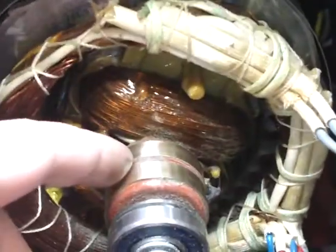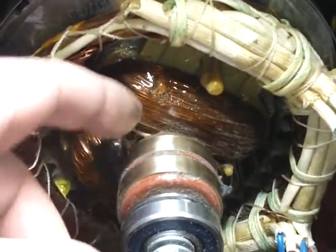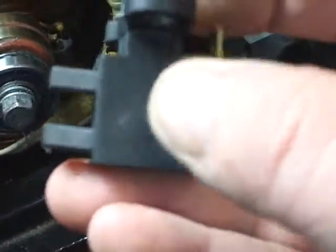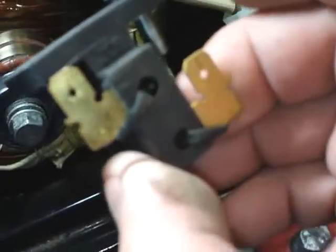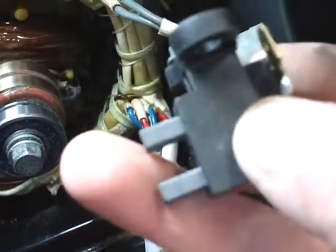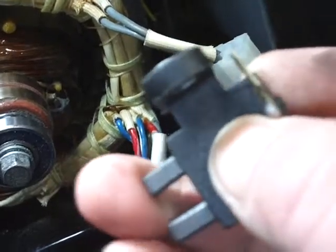While I had this apart, I wanted to show you guys the difference rather than just talking about it. In past videos I've told you there are two different types of generators. There's a brush type where you have a set of brushes like a motor has — you have a positive and a negative, just the same thing as a motor — with springs in them.